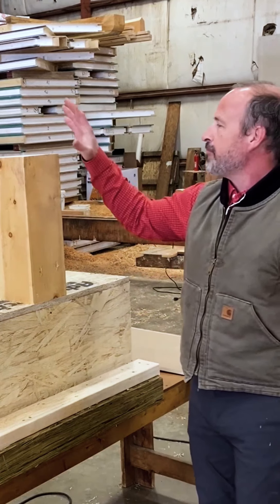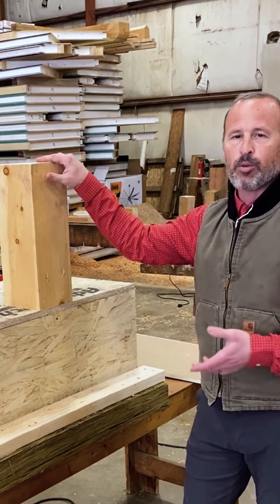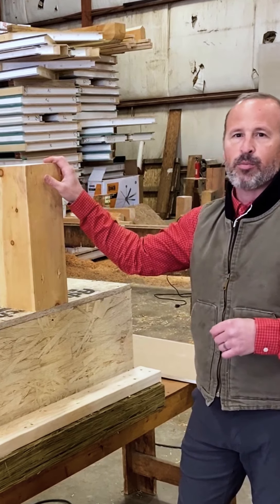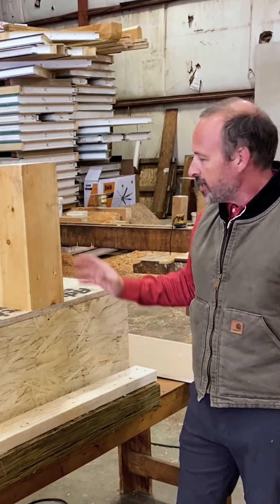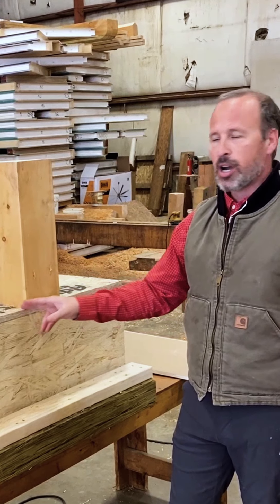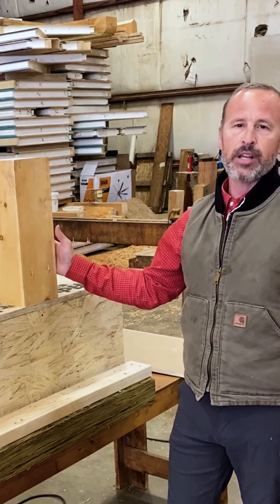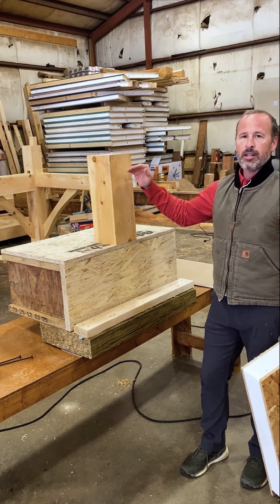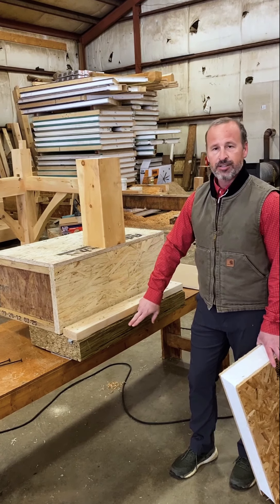As we're building the timber frame, we like to leave the posts floating around a little bit. That helps with getting braces in place and helps us manipulate the tops of the posts so that the top plates will drop onto the tenons. At some point though, we get committed and knock the posts into place on top of the first floor platform and toe screw them so they don't dance around anymore. Ultimately, we're going to use the SIP to hold the timber frame to the first floor platform and to the sill plate.